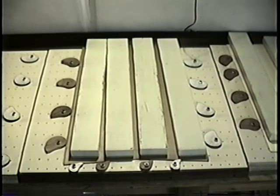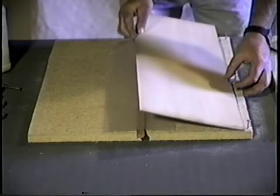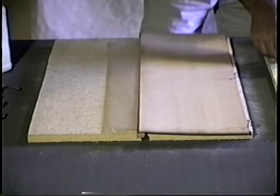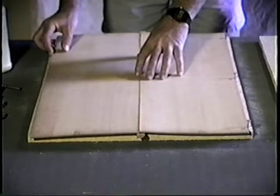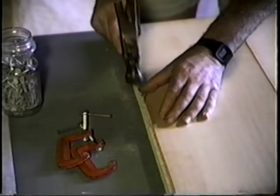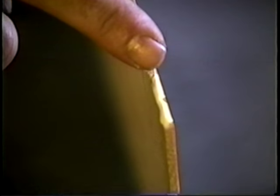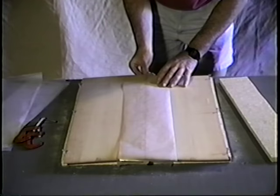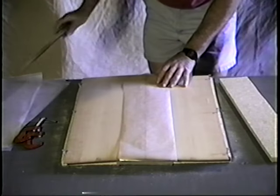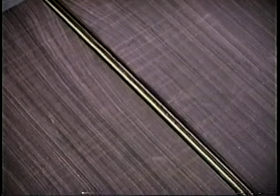We considered several jigs to hold the boards while the glue sets. We used a piece of composition board, propped up the two pieces with a half-inch thick scrap and hammered in nails along the sides. To glue, we laid down wax paper underneath, spread the glue, aligned the edges, removed the stick, placed another piece of wax paper, and secured the joint to keep it from buckling. The back was glued the same way, but we added a back strip made of rosewood and holly laminates down the middle.